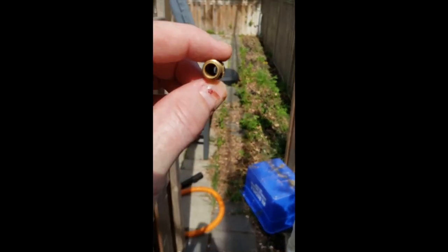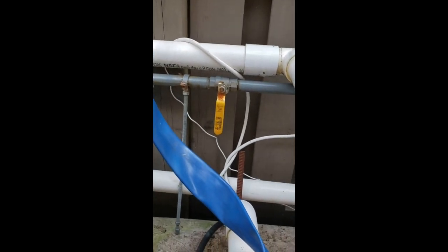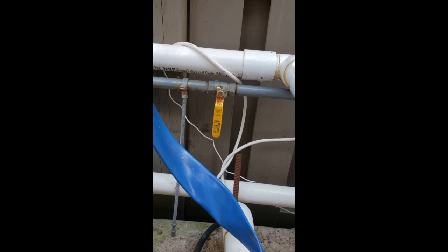You can see right through the hole there. The next step is to take this wire and put it into the holes at the back of the manifold. I'm going to look at each of the five holes back here, put the wire in, move it around, and try to push it up as far as it'll go. I'm also going to grab the shop vac and try to suck some of the debris out. Of course, I've got the gas turned off — here on this switch, and also here on the gas line itself. Perpendicular is off, parallel is on.